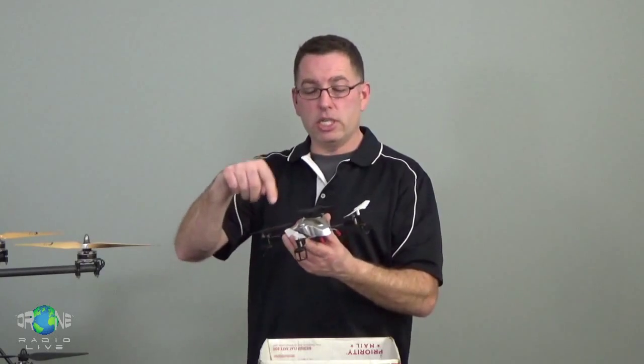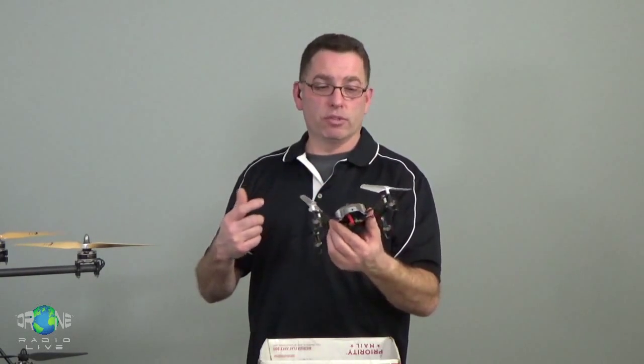Now, when it starts to move, if it's not a real sophisticated flight control system, it might start to descend because now it's not making as much lift in the vertical direction. So you have to add a little power. But the flight control system is managing each of these motors individually. If you've never flown one of these, if you've never had one in your hand, if you've been just amazed at what they do, that's how they work.